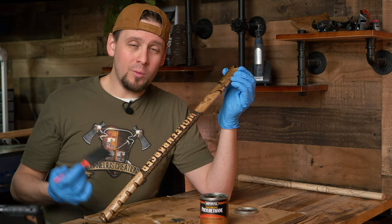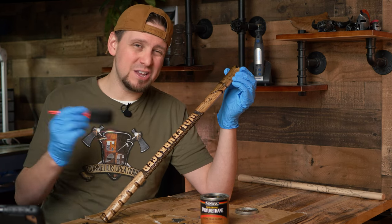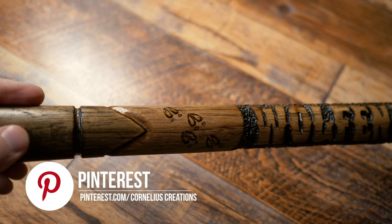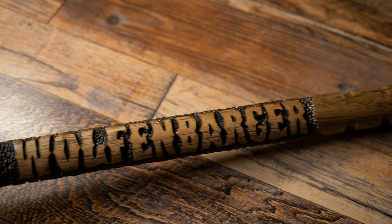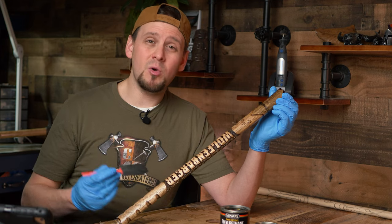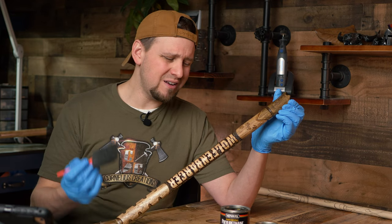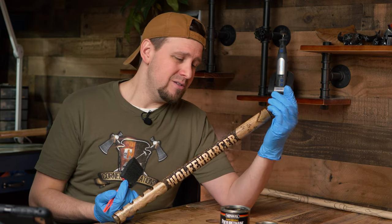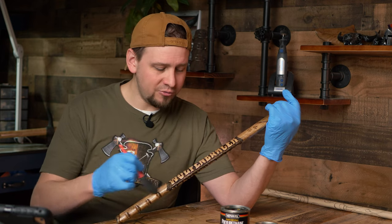Now here's what we're going to do. We're going to let this dry for a day or two, then come back and repeat the entire process — sand it and re-urethane it. By then it's going to look really great. I'll let this poly dry one more day and, wow, what a difference. Anytime I sand between the coats, I can definitely tell a difference in how nice and clean it comes out. A lot of woodworkers and furniture makers will use this technique on their projects. I highly encourage you to do your research because not every woodworking project requires this — it's just something a little extra I like to add. The last thing you want to do is mess something up if you don't know what you're doing, but for this specific project, I think it fits well.